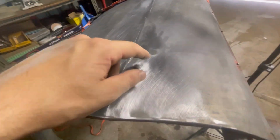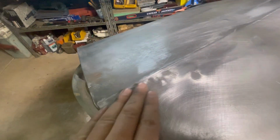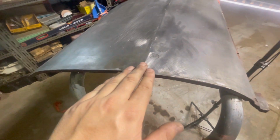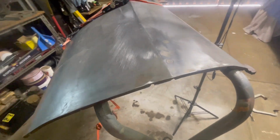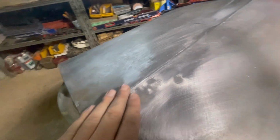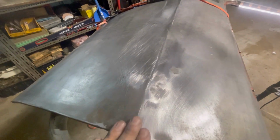They might look like they are very deep, but they're not. I think I could probably cover these with maybe 2 or 3 coats of polyester spray filler, and you know, I could block those out. That's how minor they are. They are very shallow, so probably the safest way to go for this one, and probably the quickest, is the slapping file and just that very sort of low crown dolly for this area.